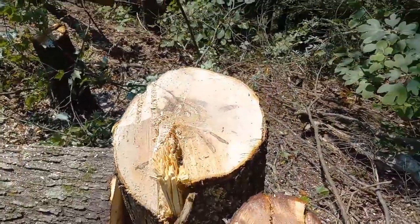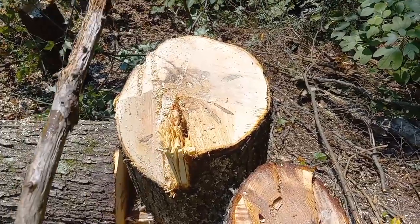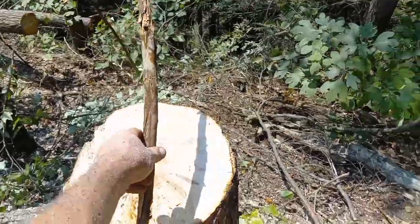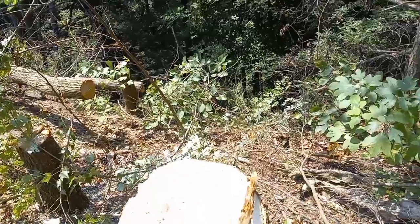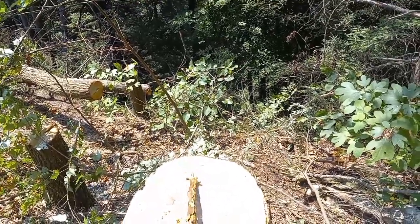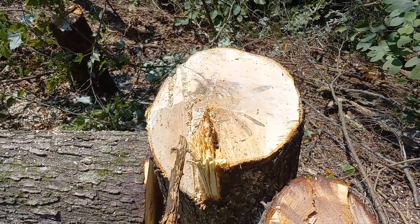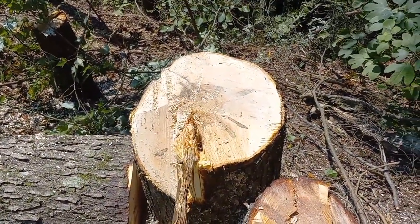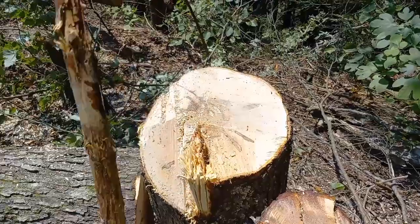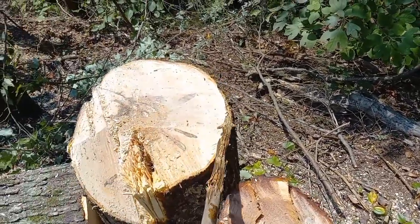A Dutchman is when you have all the hold wood on the tension side of the tree. This tree wanted to go forward over that bluff. So this is compression wood — like a jack stand when you jack up a car, this wood is in compression. It's holding the tree up on the front, on the toe. This is the heel, and it's like a chain or a rope — this is in tension. It's being pulled up the way the tree wants to go forward, and the heartwood is a gradient — it's almost neutral.